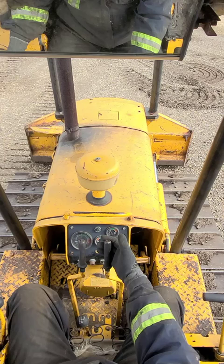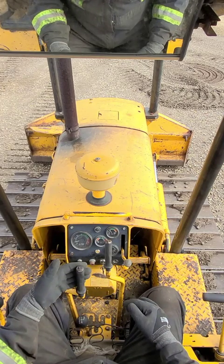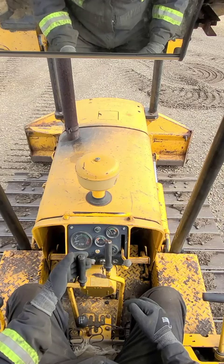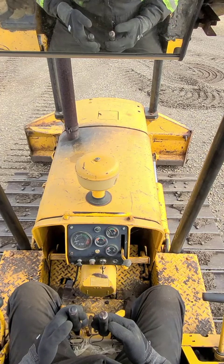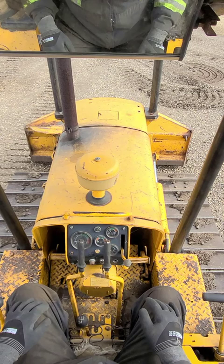Now we have left these two big levers in front of me, and this is really the whole purpose of the video. You can't feel what I feel, so I'll try to describe it — pulling the levers back halfway I feel a slight stop, and then I can continue pulling through that stop all the way back to a hard stop. So this is my steering clutch and brake control operated by my hands. Pulling it back halfway disengages the steering clutch. Pulling it back all the way keeps the clutch disengaged and also applies the brake to that side of the machine. Allowing the levers to go all the way forward means the brakes are disengaged and the steering clutches are engaged.